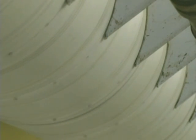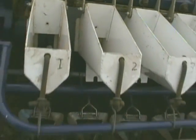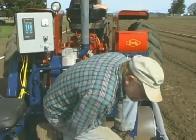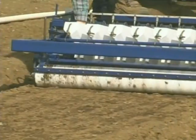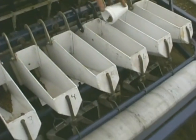The second thing the pin does is to clean the holes every revolution, so that as the seed drum goes through the seed hopper and picks up seed, we have maximum precision and the maximum number of seeds sown per foot. The operator can observe every aspect of the planting operation. He can also fill the seed boxes on the go, so that you save a lot of time going down the row.